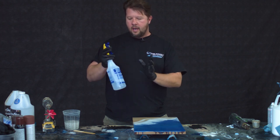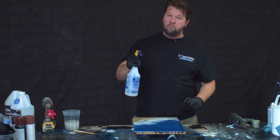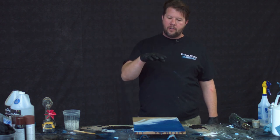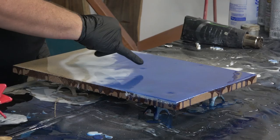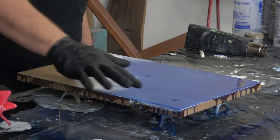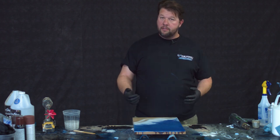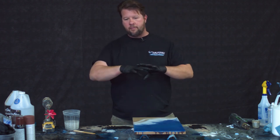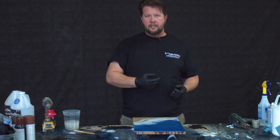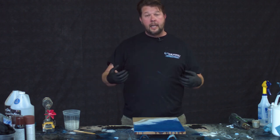There's 70%, but it's a little bit less effective. Make sure you're getting 91% for a better effect. Now, the main reason I don't prefer alcohol is it tends to make these little fish eyes in your resin — see right here and right here, that's from the alcohol hitting it and pushing the resin apart. In order to get rid of that, you'll want to just tap that out. I like to use it when I have a big river table with a really wet mix, like a deep pour resin. I'll use it there because I don't have to worry about those fish eyes. It's just easier to do on a big piece like that.